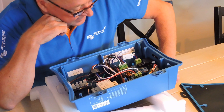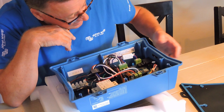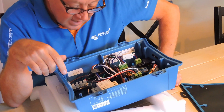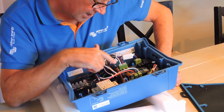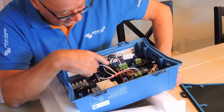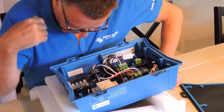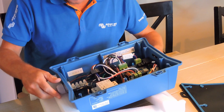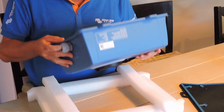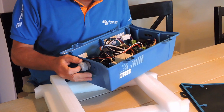There's a Wi-Fi antenna that's nicely mounted — that should give good range. CT clamps to monitor current, for both single and three-phase — L1, L2, L3, neutral, protective earth. Pretty compact, really — quite a compact board, with some big relays on there.